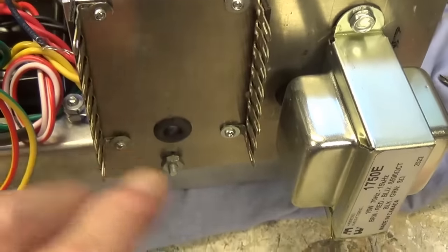Now it's time to wire the screen grids. We'll find the point immediately after the 1,000 ohm resistor on our power rail and connect a wire from that point to the junction of the two white wires from the screen grids, which is terminal 4 on each of the 6V6 tube bases. We'll run our red wire from that point down through the grommet, strip it, and connect it to this terminal so that it can carry our B-plus to the screens of our 6V6s. And now our screens are connected to the power rail.